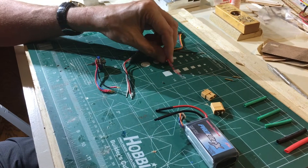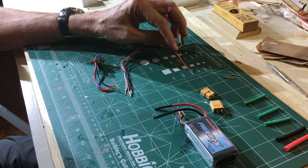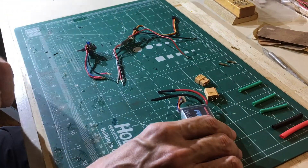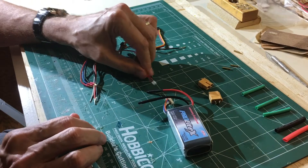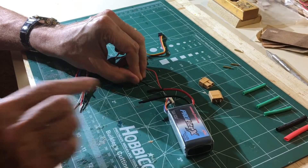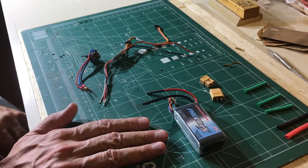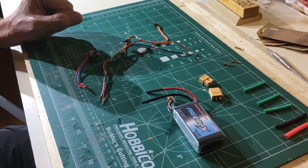On the other hand, it is super important to keep track of polarity for the electrical input from the batteries. Note: red is positive, black is negative. You have a red and a black on the battery — do not mix those up. We want red to red. If for some reason you were to solder it so that the black goes into the red, that would be a reverse polarity. When you plug it in you would short out the system, potentially damage the battery, and for sure fry the electronic speed control. Please don't do that.